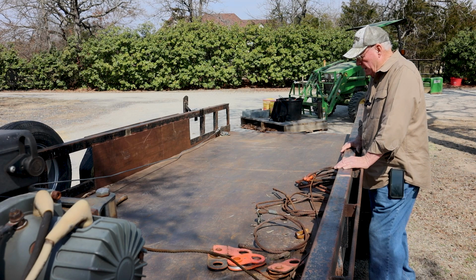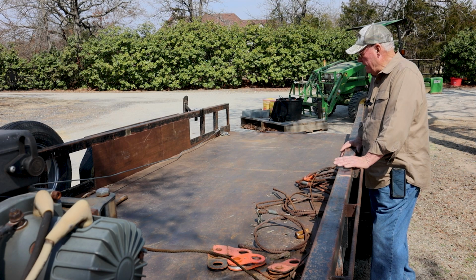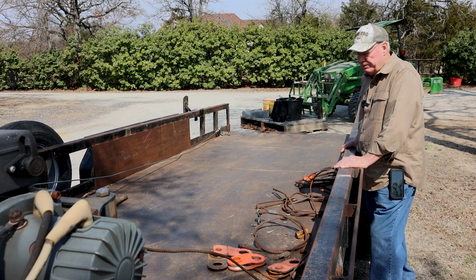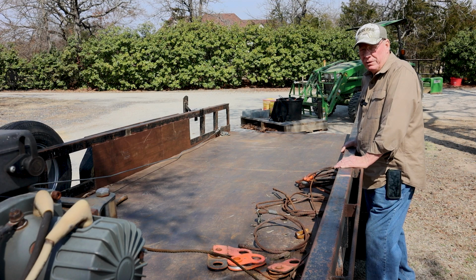The downside to it is that's 760 pounds of steel I've added to the weight of this trailer. But it's 1/4-inch steel. I've had it on there now about 5 years, and as you see, it's not dented or anything. Sometimes these joints where the sheets meet will come unwelded because of just the stresses, but Richard used to tack them when I go over there for repairs and get it back to where the logs will slide up on it. So we replaced the trailer floor because the log went through it. I learned my lesson.